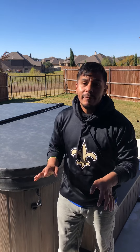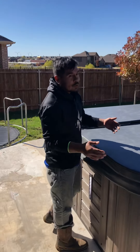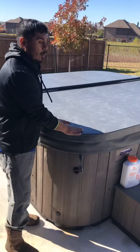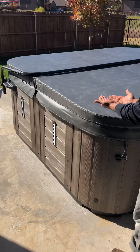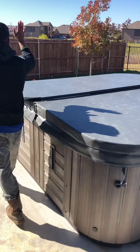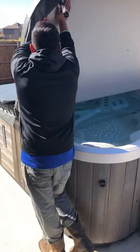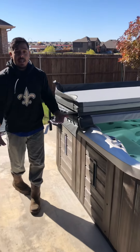When opening your top, I advise that you do not do this from the center. You can easily tweak your back if you catch a little resistance from the wind. Start from the front with your palms facing up — you're going to scoop this corner up, lift it, get your hands around it, rotate your hands around it, and allow the cover to flop over.